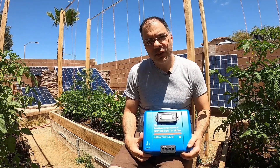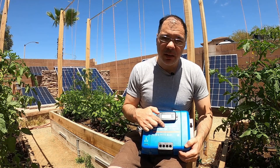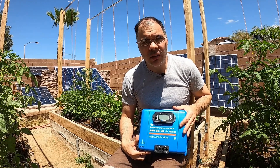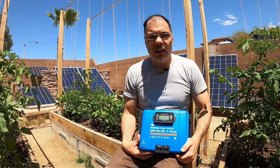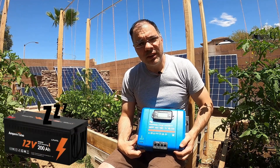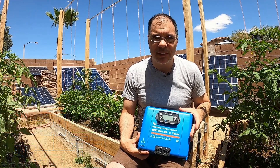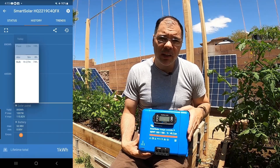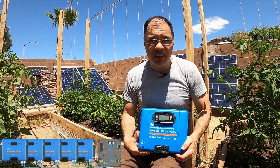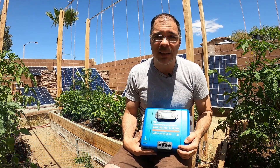And finally we will do some testing. This unit has some awesome stats: 150 volts max PV input and 100 amps of max MPPT charging output. Multiple output voltages: 12, 24, 36, and 48 volt output. It will automatically detect your battery voltage or you can set it manually via the app. It can even wake up a battery in sleep mode as low as zero volts. VE direct or VE can over a wired data connection to a GX control device or PC. On top of all that, it comes with Bluetooth monitoring and configuration via the Victron Connect mobile app. You can connect up to 25 units in parallel using VE can or 10 units in parallel using Bluetooth. That's a crazy amount of power — 145 kilowatts at 48 volts. It's like having your own power substation.